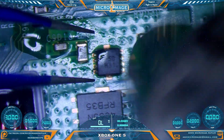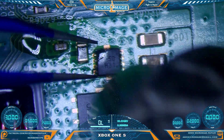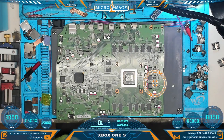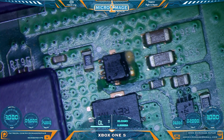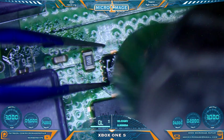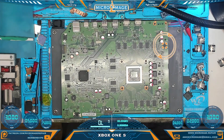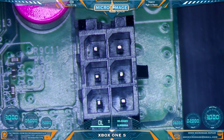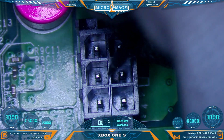If you want to move the air around a little bit — I'll just want to pound it with heat because we're hoping to use this part to fix the board. For your orientation purposes, this is the one we're going to be removing off the customer board. Let's pull this guy and see if it's also a problem — we will test before we put a new one on. Now we're going to test this connector right up here again and we want to see if we have relieved our short to ground. This time we'll be checking the left side, and it appears we have successfully relieved our short.